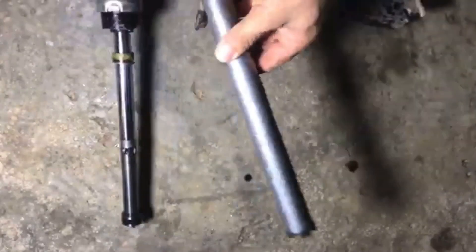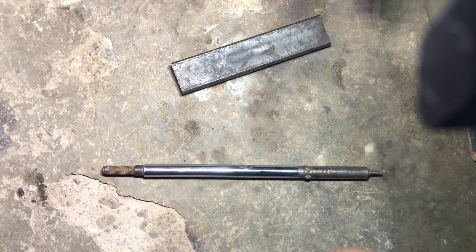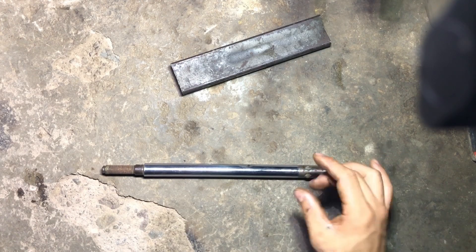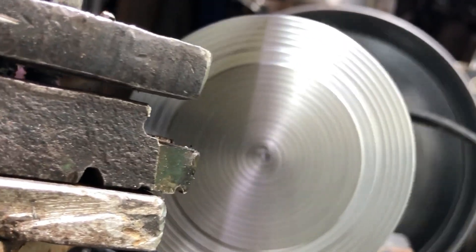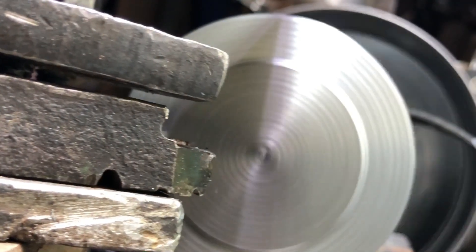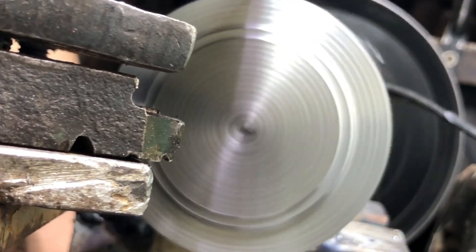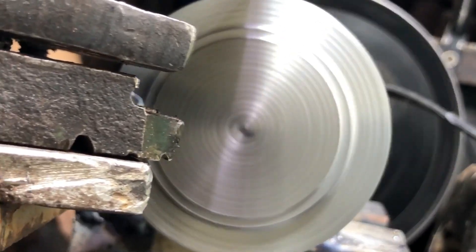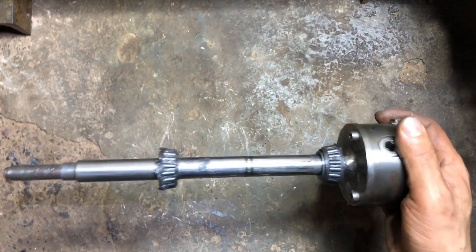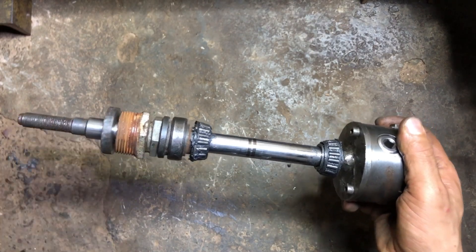The spindle is made from a car shock absorber rod. It has a perfectly polished 20 mm rod, and the tapered bearings have a 42 mm outer diameter with a 20 mm inner diameter. This is the second weld I made because I don't have a 20 mm or 12 mm tap — I only have an internal tapping set. If you have a bigger tap you can just make threads and bolt the faceplate directly onto the axle. The spindle assembly has a spacer, the bearing, and two plumbing adapters to adjust the preload for the bearings.